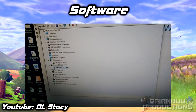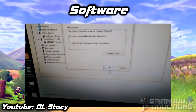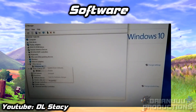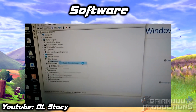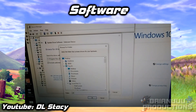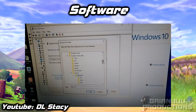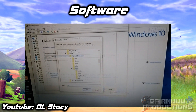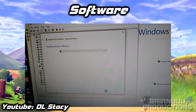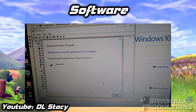The first time you do this, you have to go to the Device Manager. You will see there is an unknown device under Other Devices. Right-click on it and select Update Driver Software. Press "Browse my computer for driver software." Now browse to Program Files x86, Atmel, Flip and select the USB folder and install the driver. Now you should be able to see the device registered as ATmega16U2 or ATmega32U4.